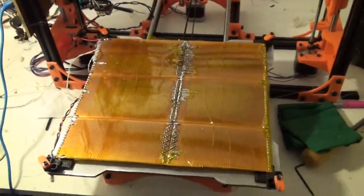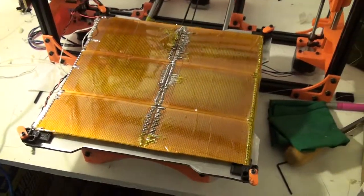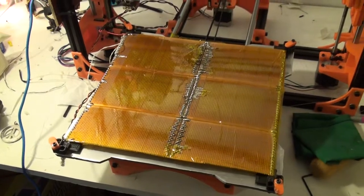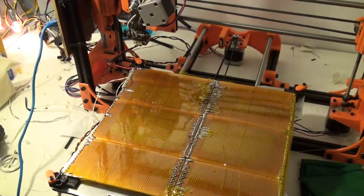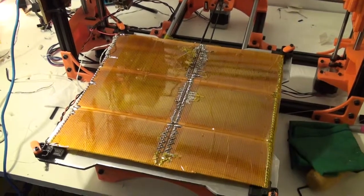When I designed this, I kind of pulled the number 150 watts out of nowhere and said that's a good number. But really I think I should have made at least a 200 to 250 watt heating element. I think I should have shot for higher power dissipation.